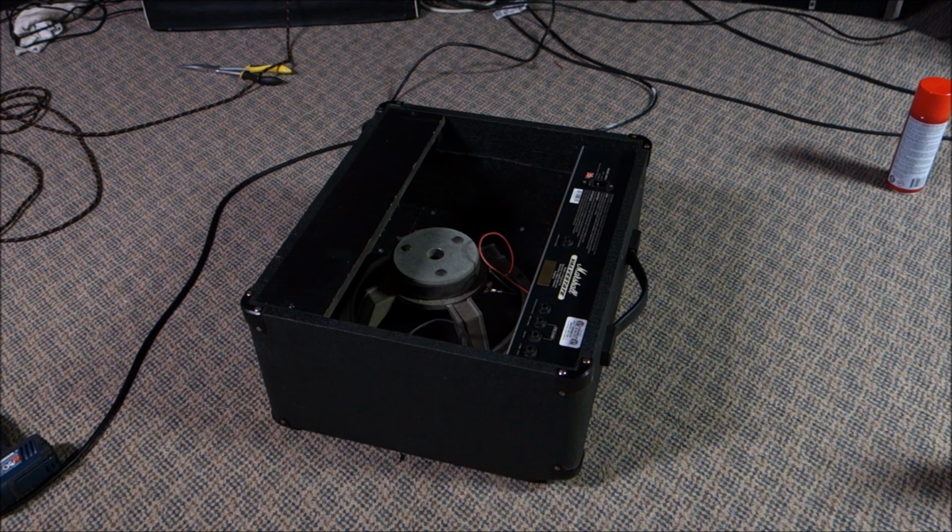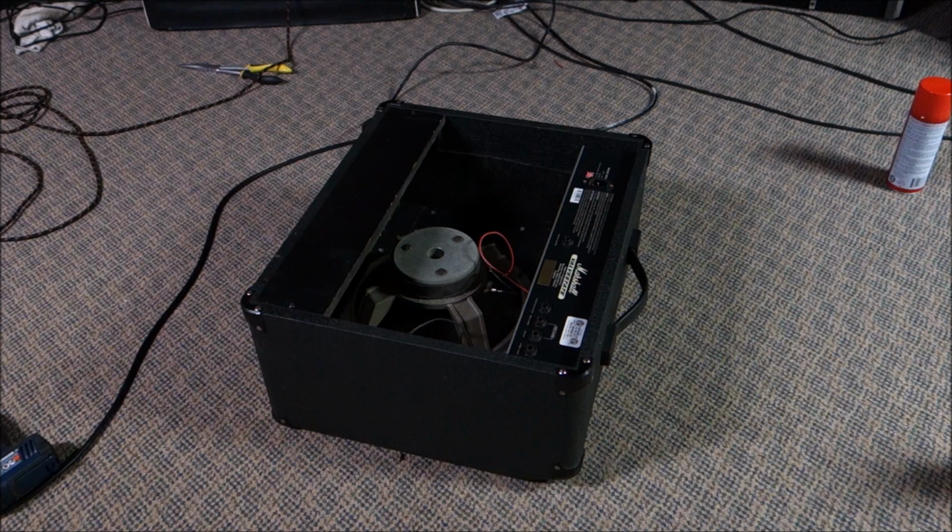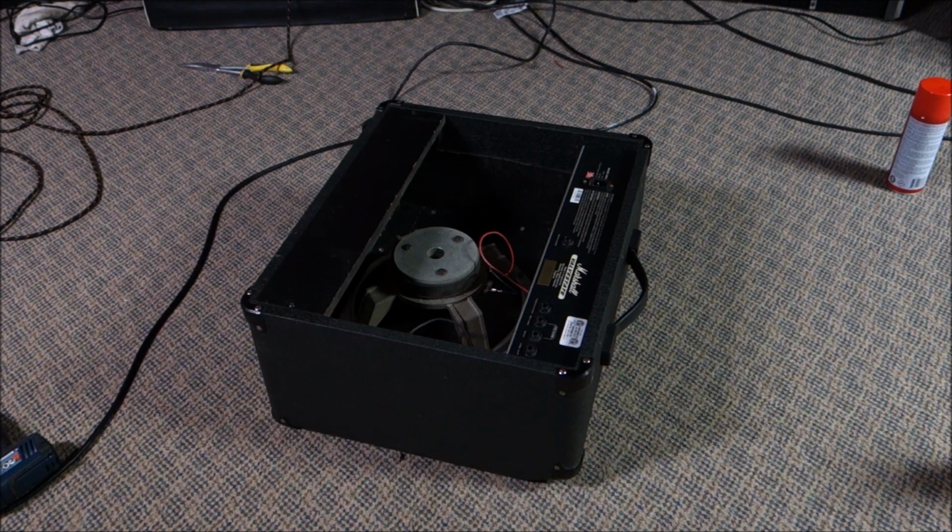The AC output, which would be the hum and the buzz, is about 0.2 of a volt. So that's actually a good thing, because if you're getting pure DC out of the solid state amp on the back end, it usually means your amplifying stage is completely blown, but probably not. So let's drop the chassis and I'll see you on the bench.